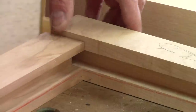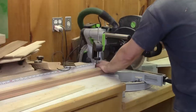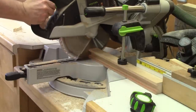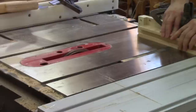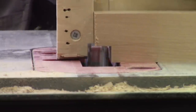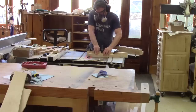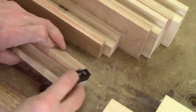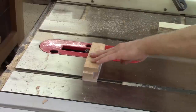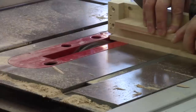It's all done, but I need to cut a stop tenon on all the rails. First thing to do is cut all the rails, then cut the cheek on one side for all of them. One side is half an inch and the other way less. Using one cutoff as a guide, I lower the dado stack to the right height and cut a test. Perfect — I just need to cut all the other cheeks.